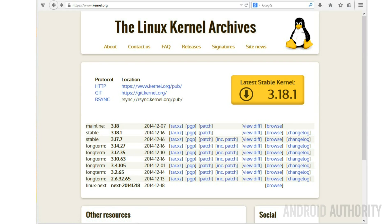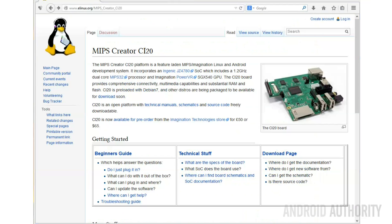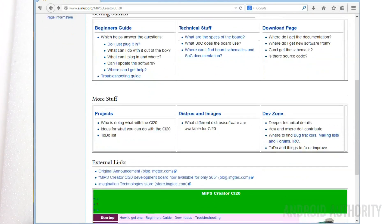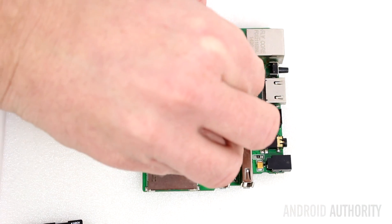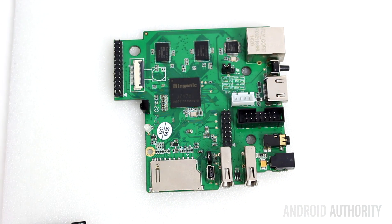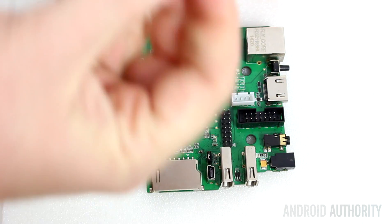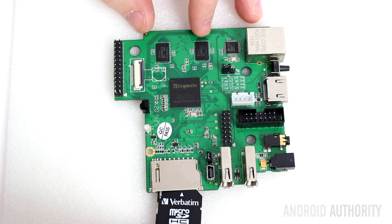Now that we've looked at Android, it's time to see what this board can do with Linux. I've downloaded and copied Linux onto an SD card, and there are some instructions on how you flash a new operating system onto the machine. First of all, you've got to make sure the device is powered off, and then we have to move these two jumpers here from positions 1-2 to positions 2-3. I've just moved the jumper there like that. Now we need to put in the SD card — here's the SD card I've prepared with Linux on it. You can get Linux from the website.